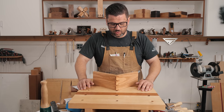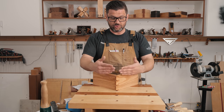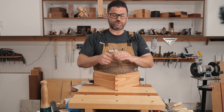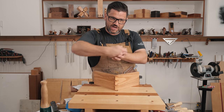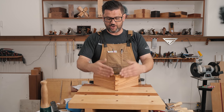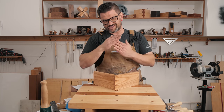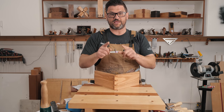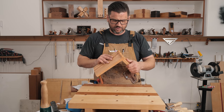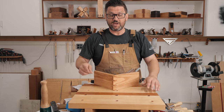Those came out so good — I love the way proud dovetails look. These are pretty extreme as far as size goes, but you could trim them closer and do like an eighth of an inch, which would look really good too. Go slow with your chisel, and when you're getting to those corners, rotate it up and make an upward motion so you're not coming straight off the corner. If you do screw up, especially with ones proud by a quarter inch, you could easily trim them off at your table saw and start over. One thing to remember: you're not going to be able to remove your layout lines after you glue it up — I didn't think about that, but some people think it looks good and some don't.